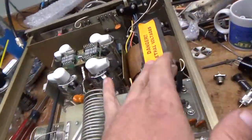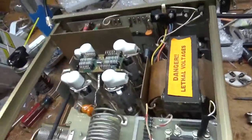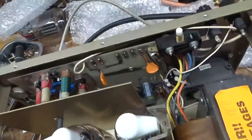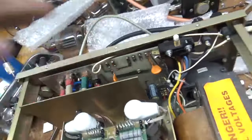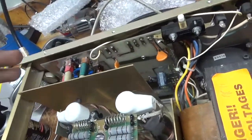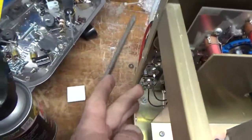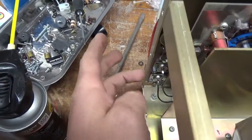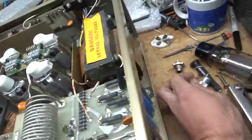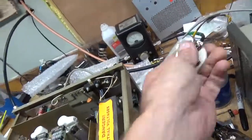I did the revisions to it. The bias mod they do over here is a voltage divider — they feed back to the center tap of the transformer for the filament. I cut the trace. Normally they just ground the center tap on the older ones to bias the tubes on. I put the string of diodes in there. I changed the SO239 connectors with gold-plated center conductor Teflon dielectric, because the old ones had no grip on a new PL259 connector. Had to replace two of the sockets.